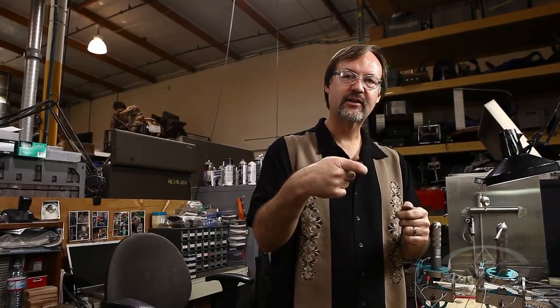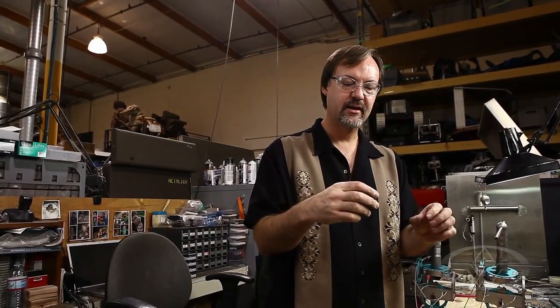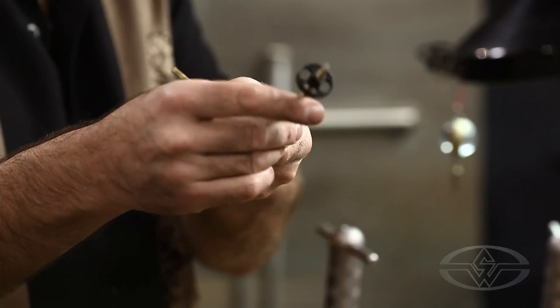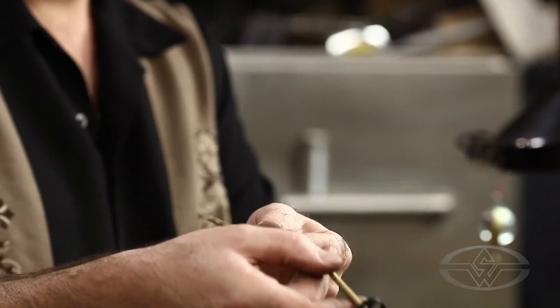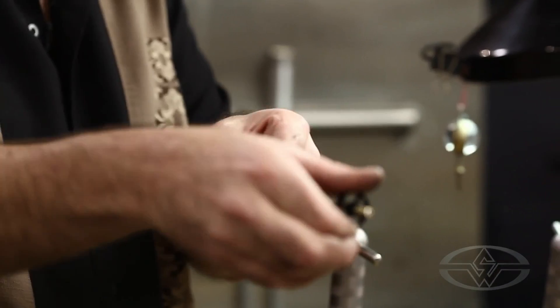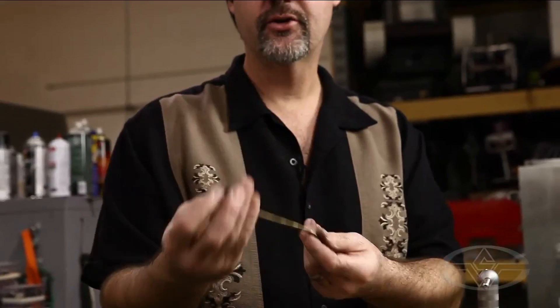This piece has to be locked down tight to the side of the speedometer cable so that when you've got them all lined up in a row, one cable always pulls one direction, one cable always pulls another direction. If they were to spiral like a candy cane, you would get an uncontrolled mess.